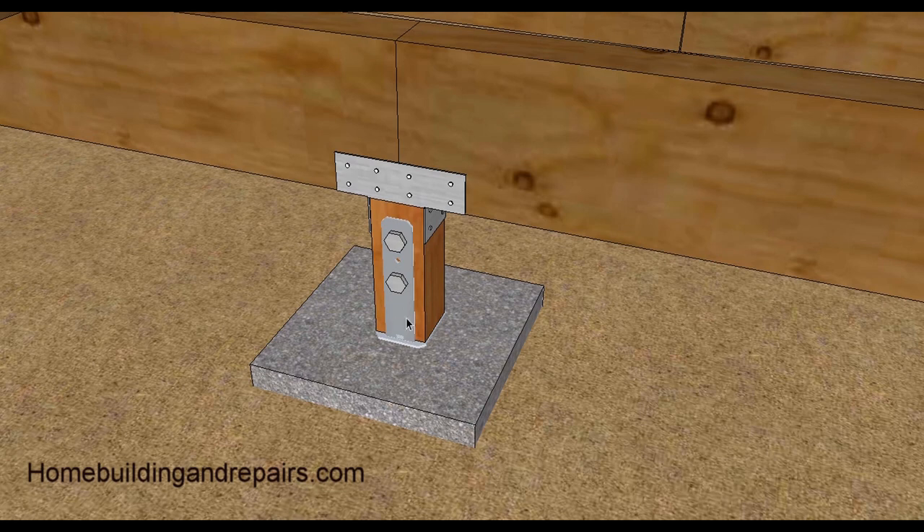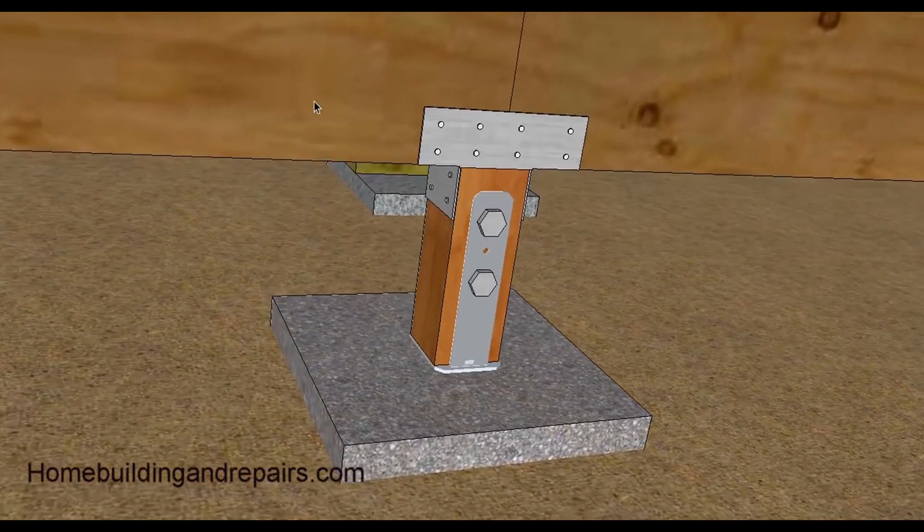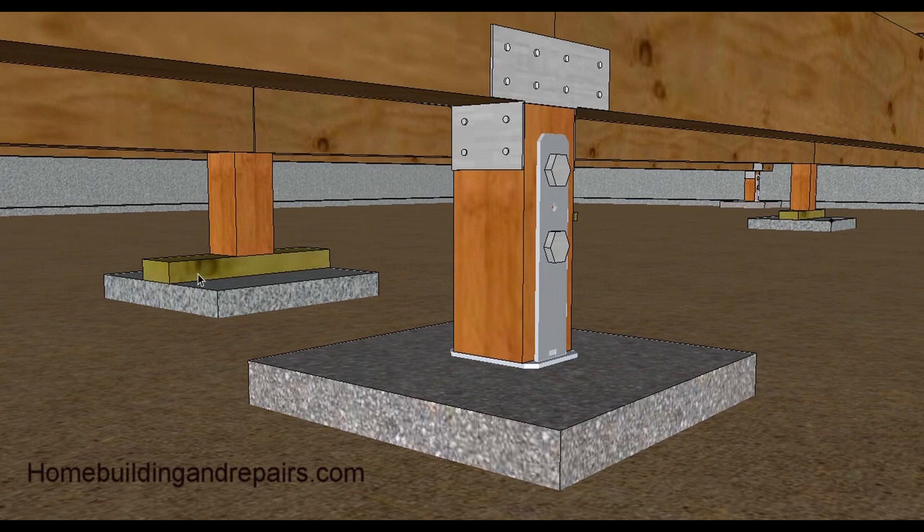Again, I'm not an engineer - just throwing out a few ideas. For a two-story home you might want to make it bigger; usually bigger is better with concrete footings, just don't make them too big. This has a post base connector and a post-to-beam connector, and these come in a variety of different shapes and sizes. They used to just pour concrete and then have a piece of wood on top with the post sitting on top of that - I've come to jobs before where none of it was nailed, yet some of those buildings lasted a long time.